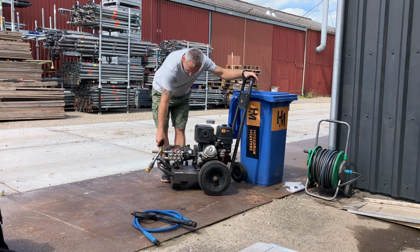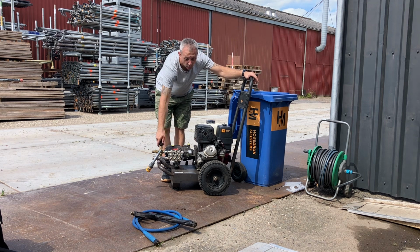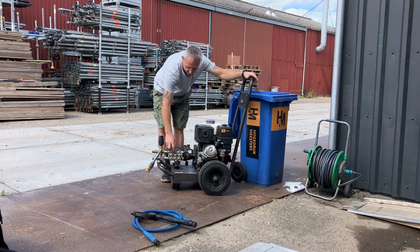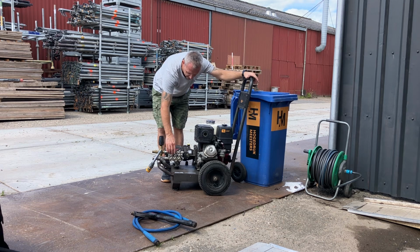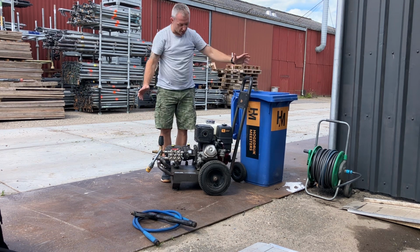And the only other thing that you'll need to know about these machines is that some, mostly now, come with a pressure adjuster, which is just literally winding in, I believe, is more pressure, winding out is less. And you can put a separate visual for your pressure on there, a pressure gauge. Literally unscrew a little bolt there, screw it in, good to go.